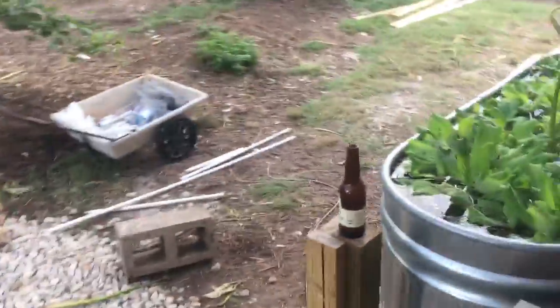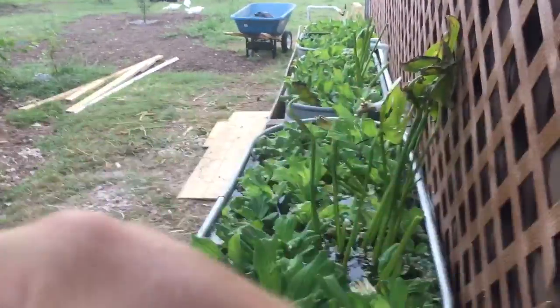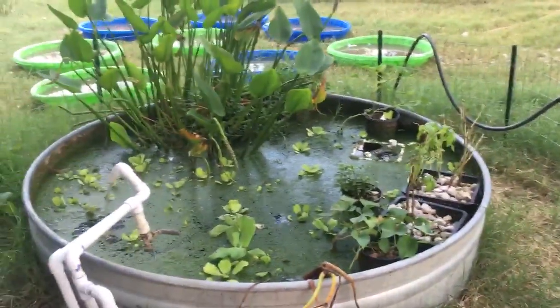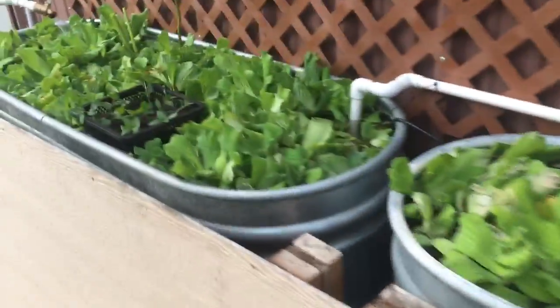Okay, if you use this method and you're a couple seconds off, don't get all flustered, because there's going to be variations in the system. This side is going to build up a little bit and overtake that side, and then that side's going to equalize out. If you're within a few seconds, just like we are here, everything is perfectly balanced. Everything's going to stay in check, and the oh shit valve is truly an oh shit valve, not a system running valve. So that's what we've got going on now.